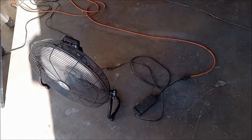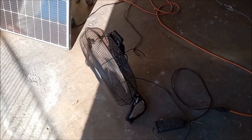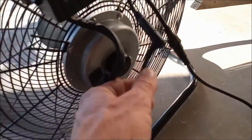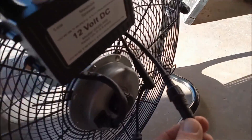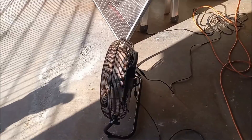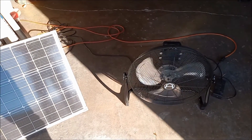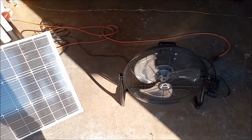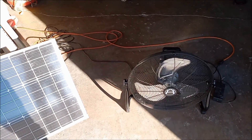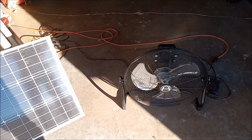So connecting to the wall adapter in place of having a battery, we're going to take a look at what that does. I've connected both the wall adapter to the fan using this connection right here, and then the solar panel is connected to the fan. Right now we're running solar direct. So if I go over here and stand in front of the panel, the fan is going to slow down because it's deprived of power. The solar panel is not generating the power it needs to run the fan. But the grid power is actually going to kick in and take over running the fan once that voltage drops to a low enough point.